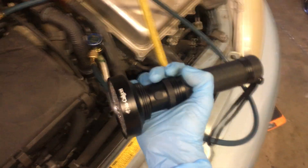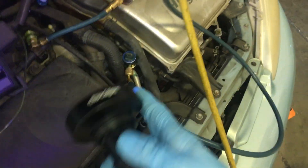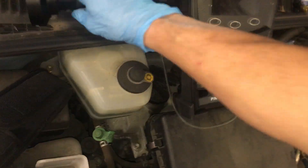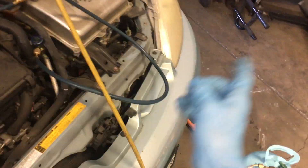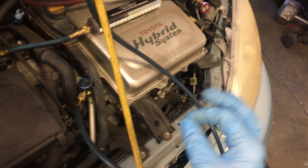My OptiMax needs its battery charged. This is the new Calgon — Calgon doesn't make anything, they just rebrand. This light just floods the area with a million LEDs and does a good job. They also have dyes in the 400 nanometer range, so you'd use UV lights that shine brightest at 400, which is very close to 395. It starts getting into the blue-light end of the UV spectrum, and you'd have a light matched to that manufacturer's dye that glows its brightest at the 400-plus nanometer wavelength.